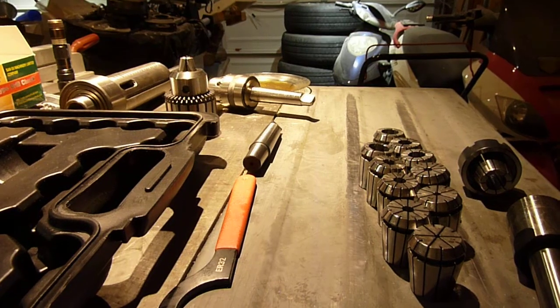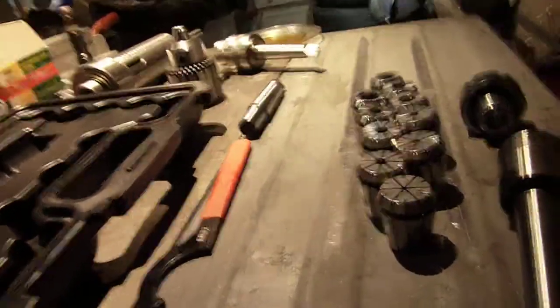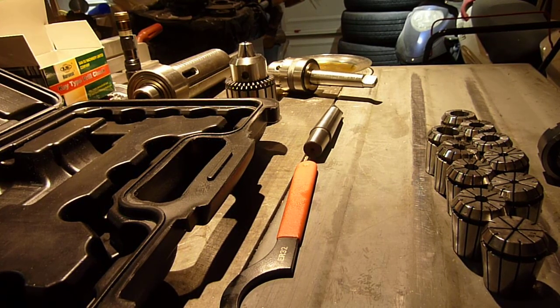When I was washing out the drill chuck, this came out of it — that's a magnet next to the side of this plate, and that's all brake cleaner and grease and grunge. A bunch of little metal filings came out of the new chuck, which was a bit surprising. Now that it's washed out, it's definitely a lot smoother, probably because of all those little metal bits that were scratching around inside.